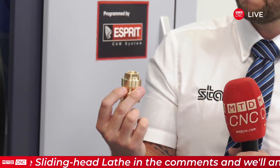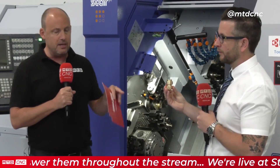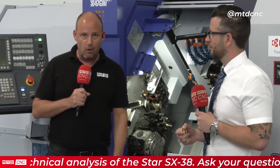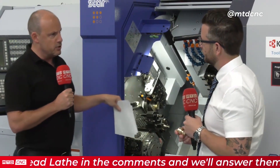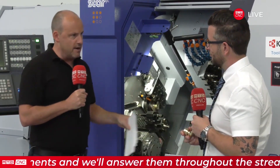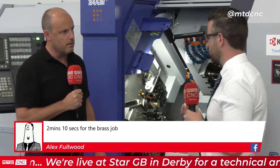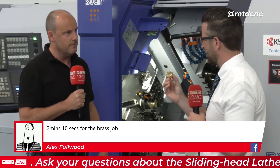This is the part we've been asking you to predict the cycle time for — there's still time to guess. We'll be announcing the winner at the end of the show, and we've already had over 250 guesses so keep them coming in. When I look at this sort of part I think if I wasn't doing it on a machine like this I would have to have maybe two or three machines in the shop. This is where the machine really comes into its own. We're talking to more people now that have got older machine shops with VMCs and lathes who need four or five different operations to make a component and want to make it more efficient.